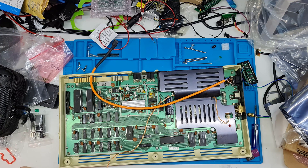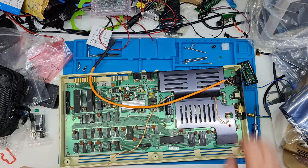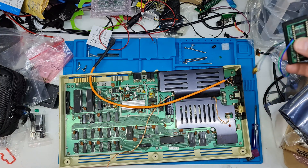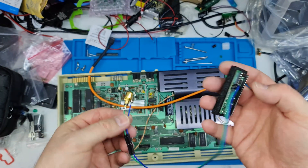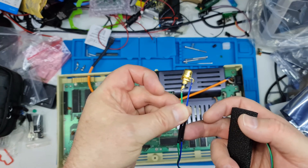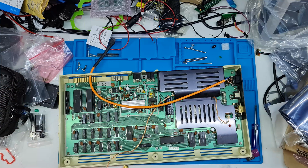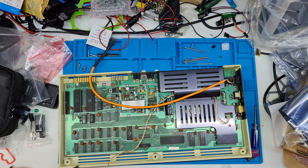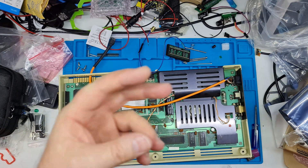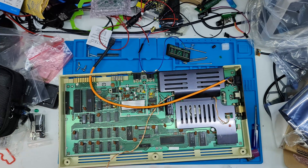We're going to pop the VIC out, put this board in its place, and fire it up. Mine came with pre-fixed cables as well as removable cables and a connector. That's probably because in the VIC version there's no modulator to hijack, whereas normally you could just sever the wires for the RCA at the end of your modulator, solder straight to them, and bam — you've got an instant LumaCode connection.